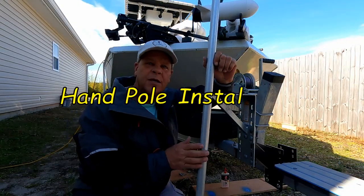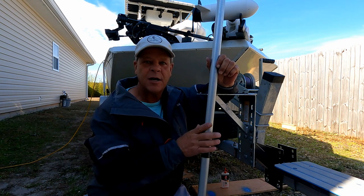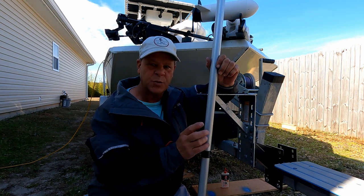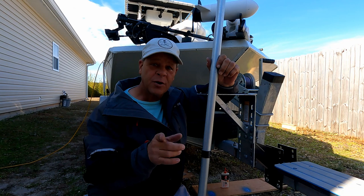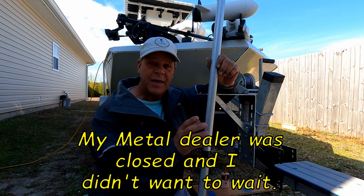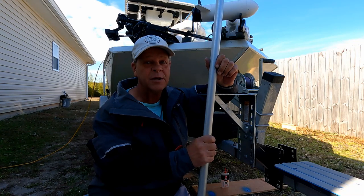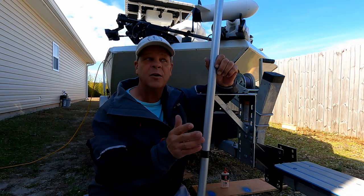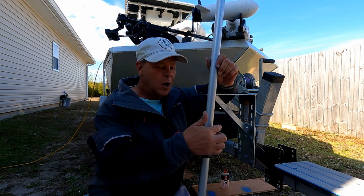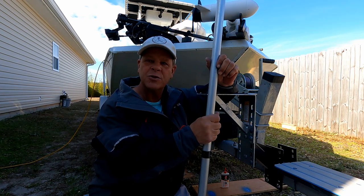You can make your handle out of many things. This is one-inch EMT conduit, which is a thin-walled conduit — I would have preferred a thicker-walled conduit but this will do. The perfect thing to get is one-inch, one-and-a-quarter, or maybe one-and-a-half inch square stock — that is going to be so much easier to mount. You can get it in steel or aluminum. Aluminum is nice and light but the corners are kind of sharp, whereas steel corners are more rounded so it'll be more comfortable.